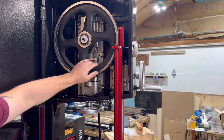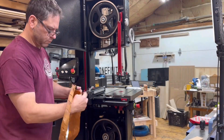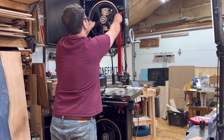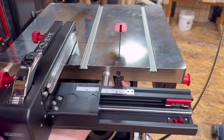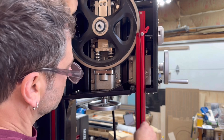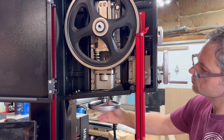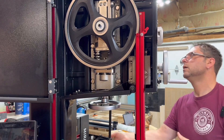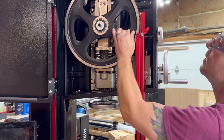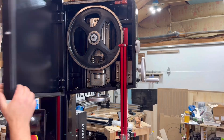Now I'm putting on the resaw blade that actually comes with the machine — it's really well wrapped. You take it apart and put it on there. The hard part, like with any bandsaw, is fitting it in place. I keep forgetting to unscrew the little part here. You just put it in through the side. The blade guard is really well designed — really tall and long, so nothing dangerous there. Once in place, you tighten up the tension bar at the top to get correct tension. There's that window again so you can see where the blade sits. Lock everything, close it up, and you're good to go.